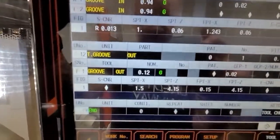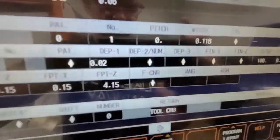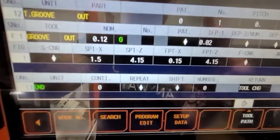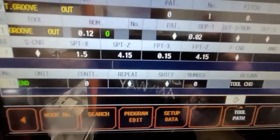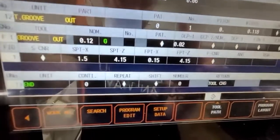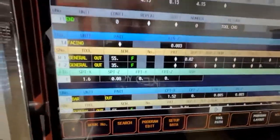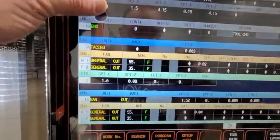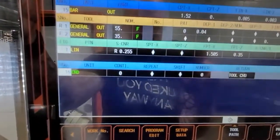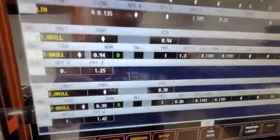Now the cut-off: groove pattern zero, number one groove, width 118 thou, starting 1.5 inches, four inches and 150 thou on Z, dropping to 150 thou deep. That's enough - when you have about a four inch part you can hit it with a sledgehammer and it'll fall off. Then we have an end - that's the first operation. Second operation is just facing and putting that radius in the corner. And another end, so that's the second operation. That's an example of this part.